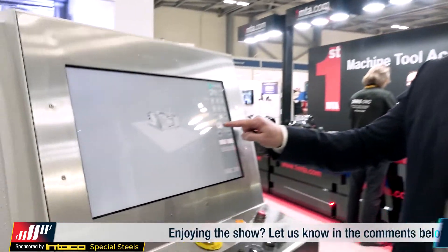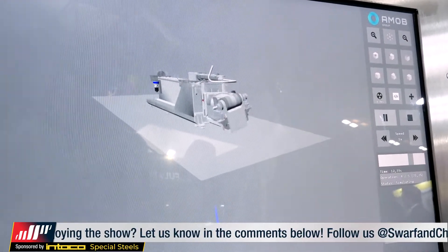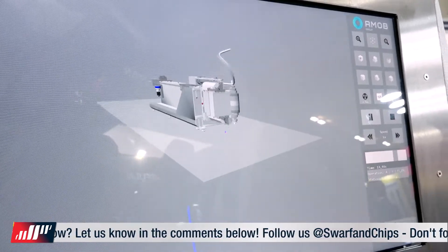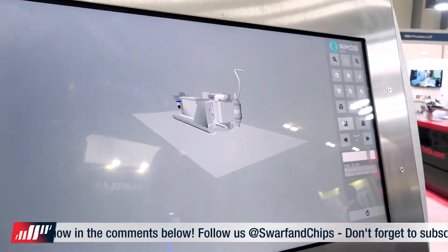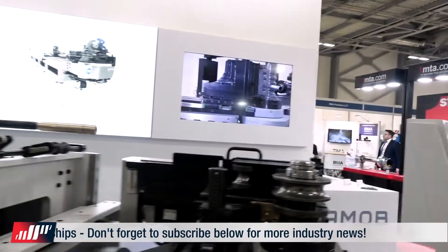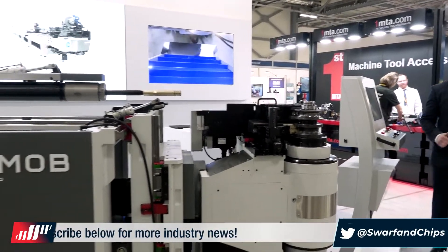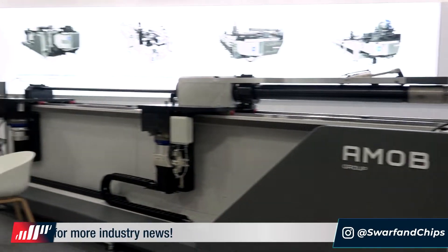Come and have a look at this simulator — you'll see that it bends clockwise, the head drops down, swivels, goes back up and now we're bending counter-clockwise. So that is bending technology for those pipe benders out there in a nutshell. Now look at this machine very quickly — what sort of length will you go to? This is a 4-metre useful length machine. It's 52mm diameter and can bend stainless, copper, mild steel and everything in between.